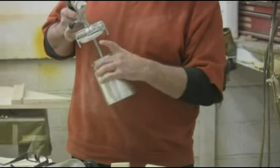All right, guys. First coat is drying. Now what I'm going to do is scuff this again, blow it off good, and put a second coat on it. Because it's a water-based paint, that's the key. I don't care if you just buy a latex paint. You're not going to get a latex or any water-based paint to flow out, level out like a finish. It's just not its nature. It's not what it's designed to do.